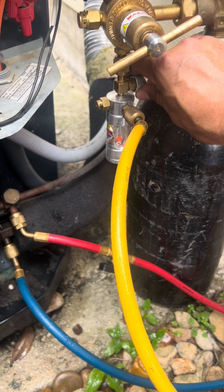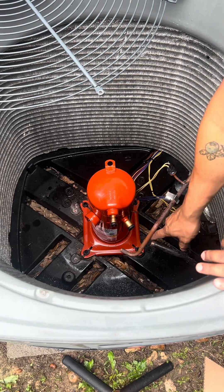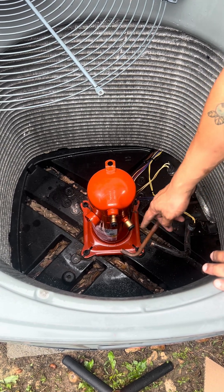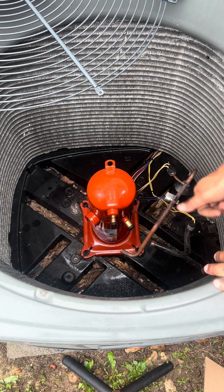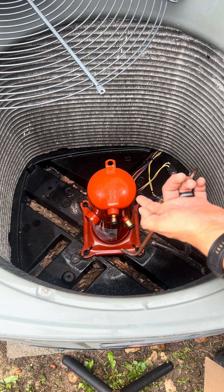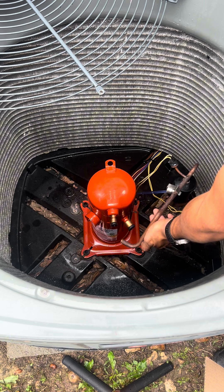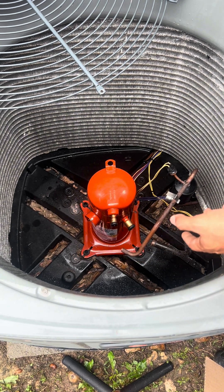I have it set to braze. Inside here we have an entire kit to help us retrofit this compressor — it comes with the feet, the harness, everything that we would need to get this job done. I just need to get a piece of copper from here to here, then cut and get a piece of copper that goes around this way. The compressor harness is going to be on the back side, but it's all about making the job easier. If all the pipes and everything are working fine, it doesn't really matter how it's configured — this is a retrofit kit.